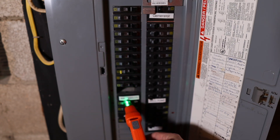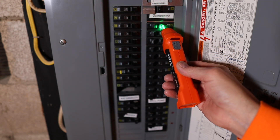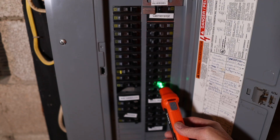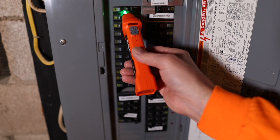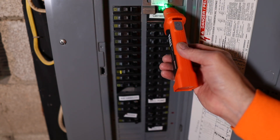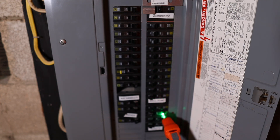The second time is when you listen for a change. When you get close to the breaker, that green light will start to beep faster, which means you're getting closer. And when you get to the breaker, you can see that the green light goes out and it lights up red. You can do this a couple times if you want to just be sure that there's no interference and you definitely have the right breaker. It's pretty clear that that's the breaker.